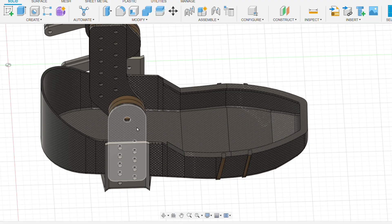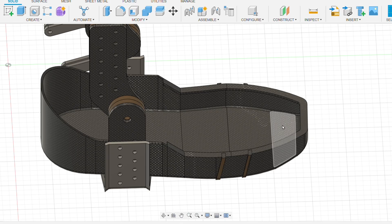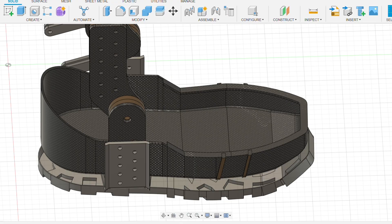This is a 3D print that will then be lined with kevlar and carbon fiber. The reason I'm keeping the 3D print rather than using it as a mold is that if you scuff the sides on rock, I don't want you to go through to the actual composite material — the actual strength of the boot. Especially with carbon fiber, it goes all needle-like and horrible. If you scraped down the side and touched exposed carbon fiber, you'd have little carbon fiber needles in your hands, so keeping the 3D print prevents this.